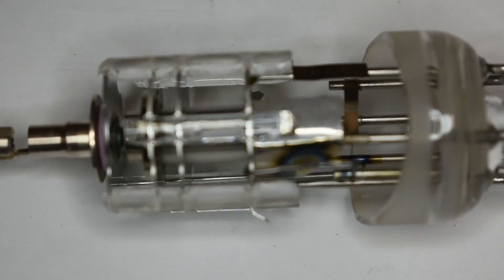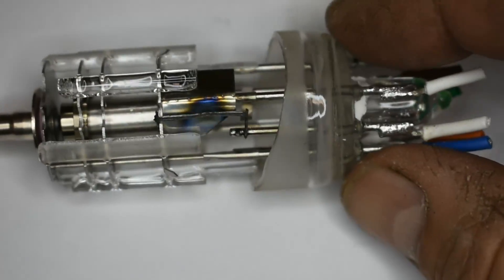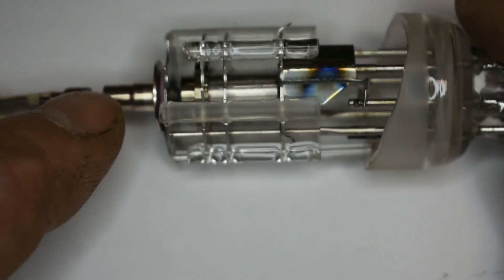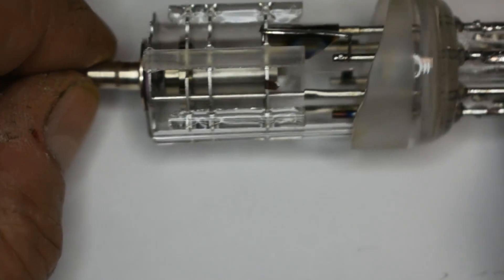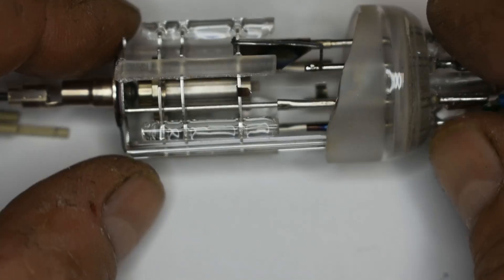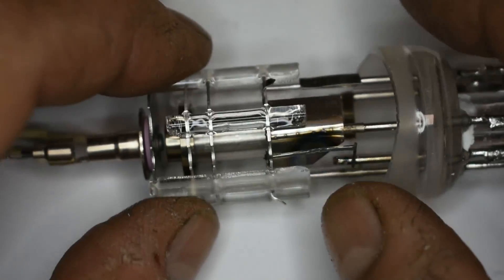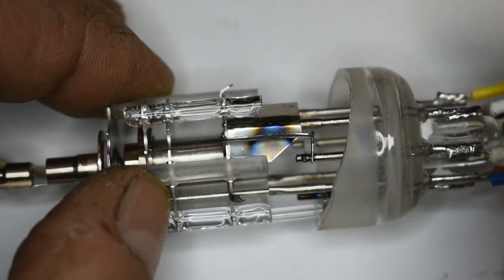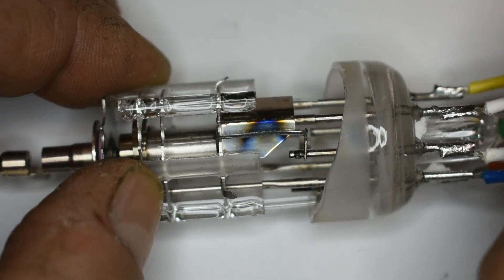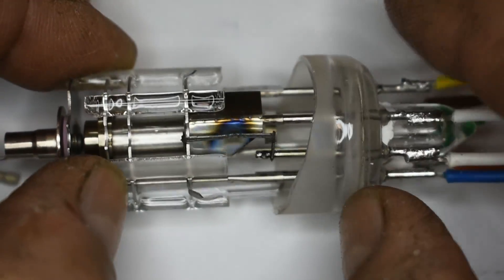There are a few connections in here worth looking at. Tracing these through, there is actually a connection to the helix coil which goes down onto one of the pins, and there's also another connection to this point here — so there may be some focusing arrangement being done to the beam before it exits the gun. Interestingly, this is the getter for conditioning the vacuum, and it actually looks like it's physically connected in a loop with two connections that could fire just by passing a current through it, rather than being inductively fired.